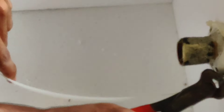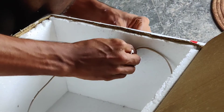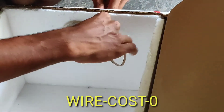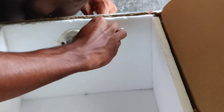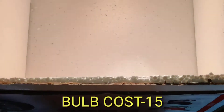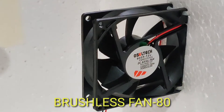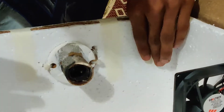Next, I found a bulb holder lying around in my house. I have fitted it with local wire. Right now the total cost of my incubator is 40 rupees for the thermocol. I have purchased a 40-watt Philips bulb which cost me 15 rupees and have fitted the bulb — it produces quite a bit of heat. The next thing I bought from Amazon is a brushless computer fan.